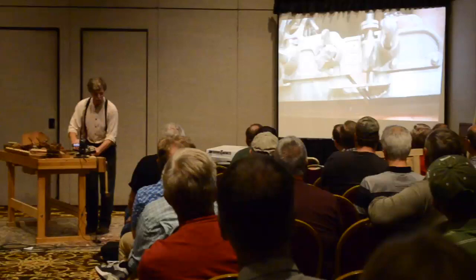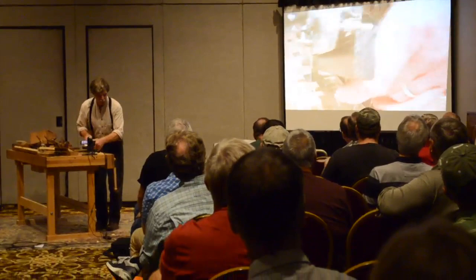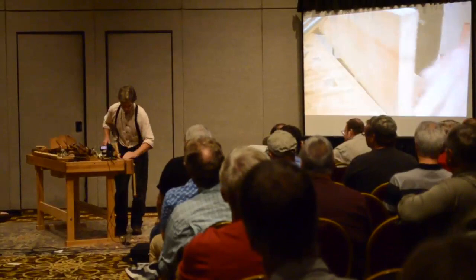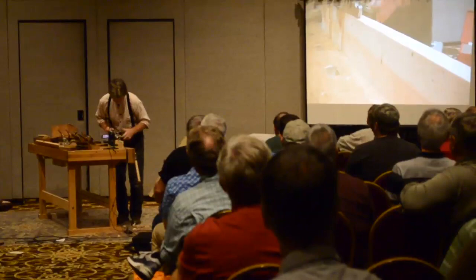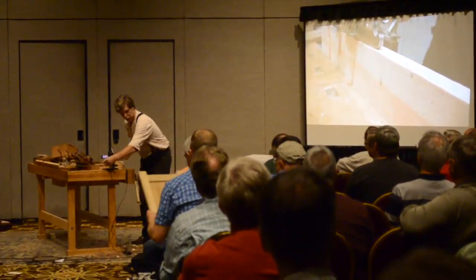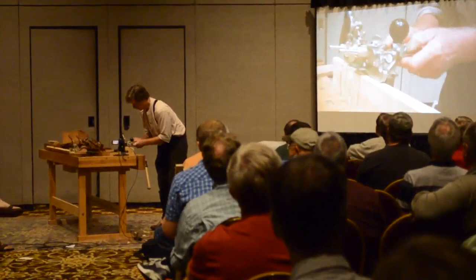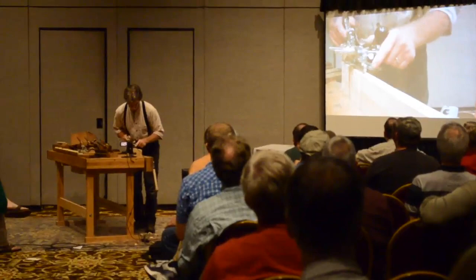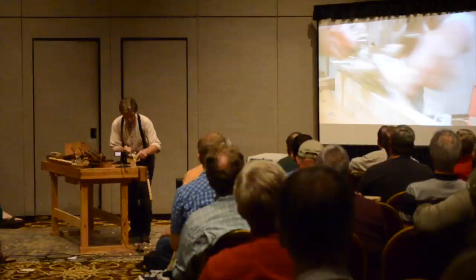So here we are - we've gone to 1845 to 1880, we just brought one of these home, look at this, isn't this great! Look at all the stuff I'm going to make now. You see the two adjustable skates there and the fence - just turn this piece over and we'll be grooving. I've got to move the fence in - it's set too far out. Undo the two thumb screws here on the fence, pull it over, get it right where I want it, tighten down that thumb screw and that thumb screw. There's a thumb screw there on the rod. I've got all these lightweight cutters.